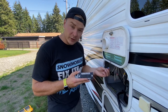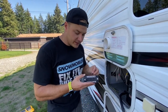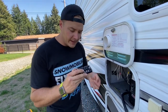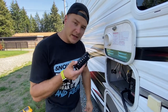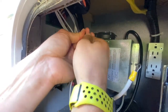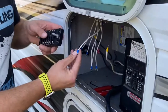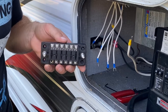I'm going to put little terminal connectors on each one of the wires coming in and out, because that'll fit better with the way they have the nuts and washers set up here, rather than just putting the wire straight on there. It's really short in there and there's just not enough room, so it'll be best to put these little connectors on there and then hook it up to the bus bar from there. I went ahead and put ring terminals on each one of the wire ends so they'll fit nice and easy behind these screws and I can tighten the screws for a solid connection.